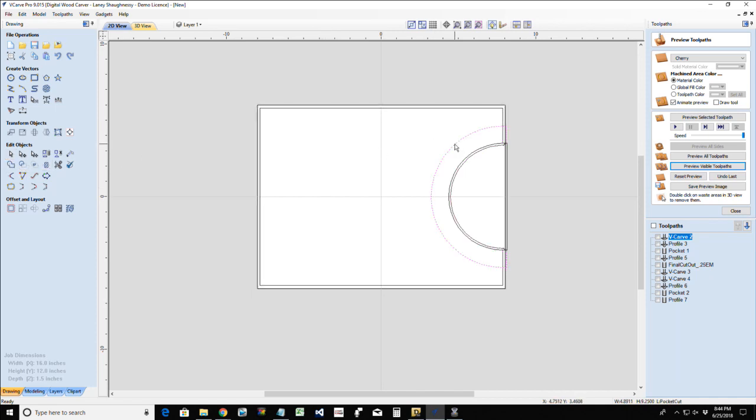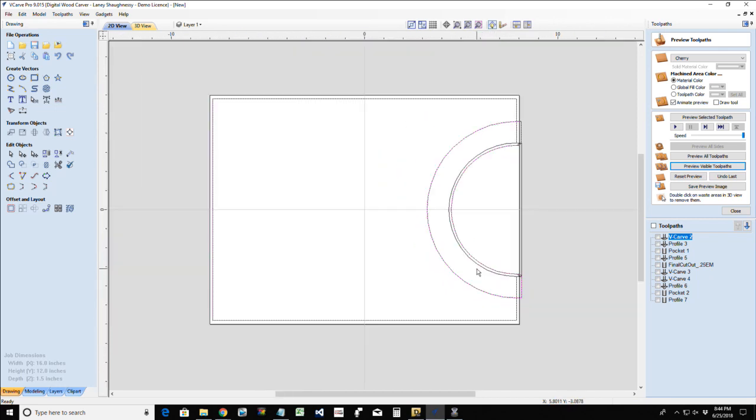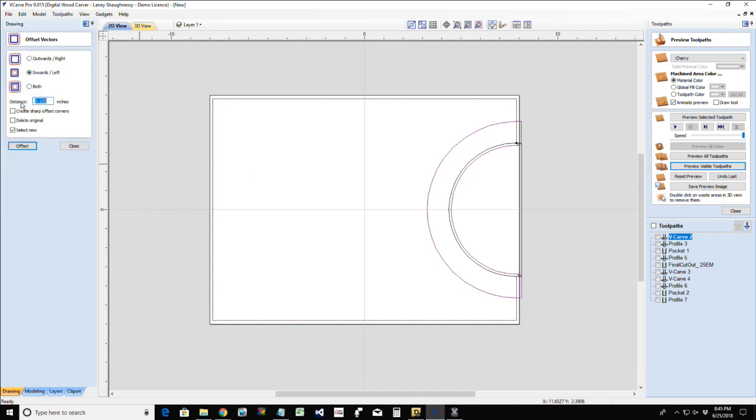If I were creating a juice groove for this, I would essentially select these two items here and I would copy them and then turn around and paste them, and then I would weld them while they're still selected, and let's make sure that welded correctly. Did it? No, it didn't. Control Z. Now they're already together. So I would offset those inward a good quarter of an inch or so, quarter inch or half inch, because I'm working with a 3/8 inch box core bit, so at least 3/16 or more. So I'd probably go about maybe 0.375 inward,